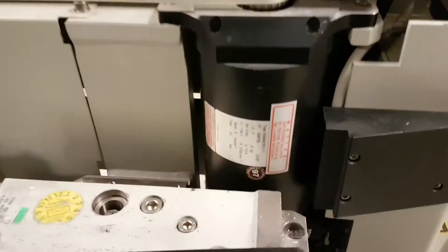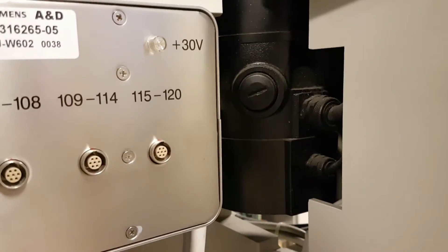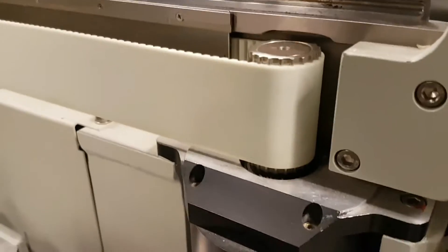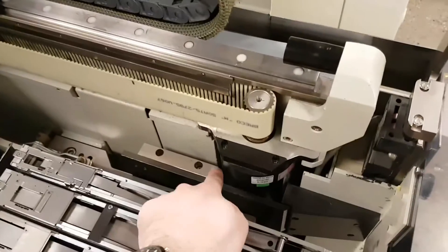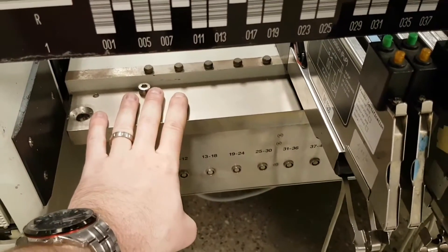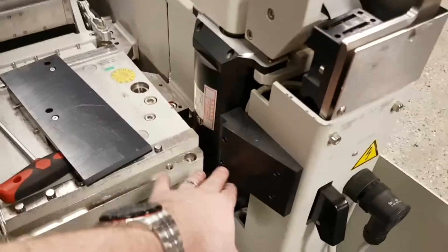So I've pulled the guide plate off this one. This is a 104 volt, 5 newton meter, 15 amp motor — but it'll max out at 88 amps — 2700 RPM, fully encoded motor. That motor runs from here all the way down to here, where the bottom part is its encoder, so it has an integrated encoder. The T5 belt is built onto it. Normally there's a guide plate there for pushing the feeders in on. This is a completely separate unit which weighs a couple hundred kilos and gets forklifted in, so those plastic pieces are to guide that plate in.